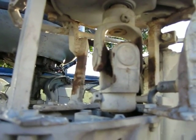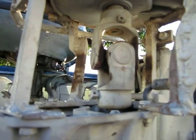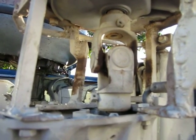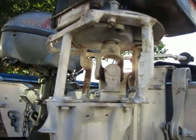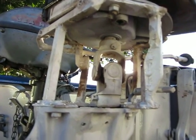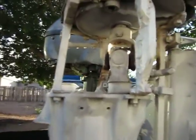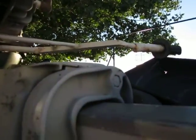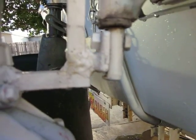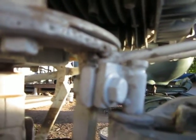Using the u-joints, you can very easily adapt it. I think the u-joints are a lot better because you don't have to line up the engine with a coupler perfectly straight with that shaft. My welding handiwork — I mean, the welds held, but I just used scrap metal I had laying around. I bolted the engine to this frame, welded a rod with a dirt bike grip on the end for the tiller handle, and used the transom clamp off of the Johnson — just bolted it to the lower and welded up to the upper.